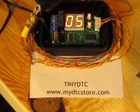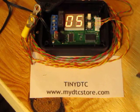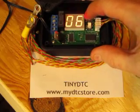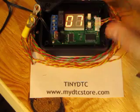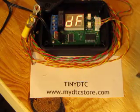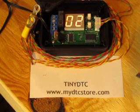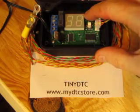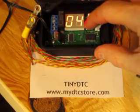First is the delta on. This is the differential between the two sensors that will turn it on. So if T1 is greater than T2 by 5 degrees — or 7 degrees, let's say — it will turn on. Next is the delta offset point, set for 2 right now. You can change that to whatever you want, so long as it's less than the delta on, which the unit enforces.